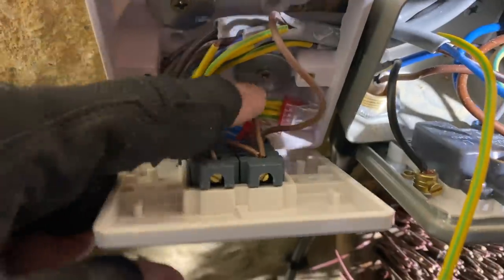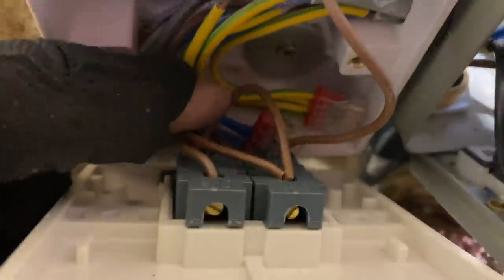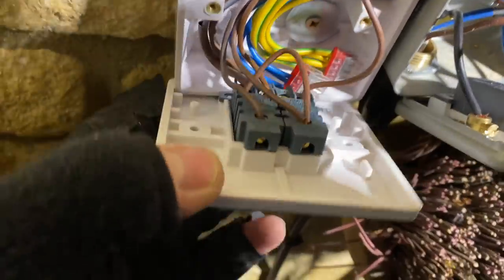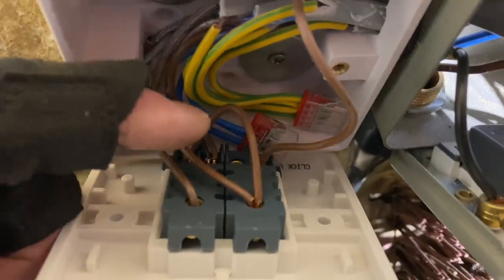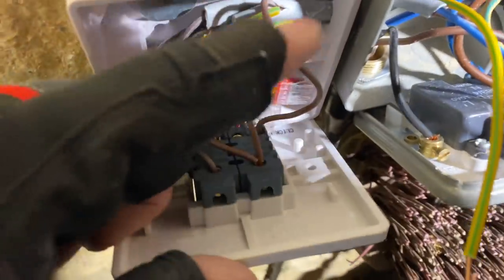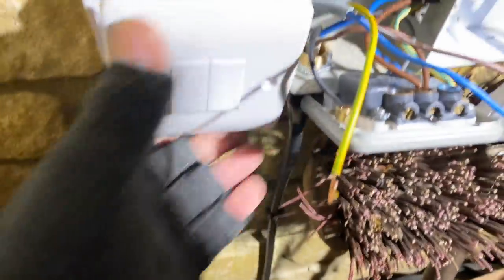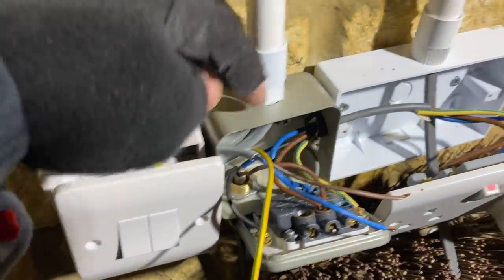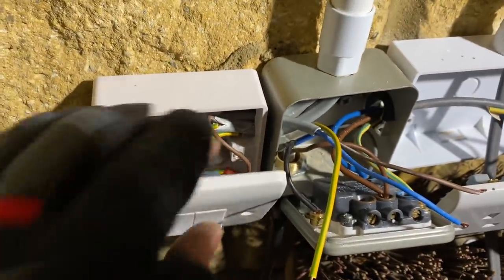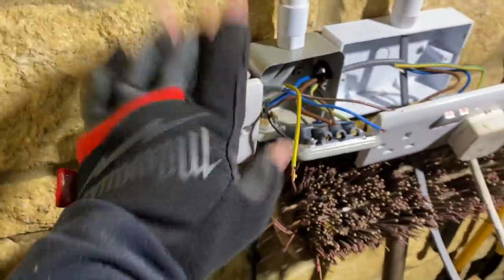Getting dark now. Got our two-way lighting wiring to explain: earths and neutrals - a neutral for the flood, neutral for the garage lights, and a feed neutral - so three neutrals. Then the two-way: three-core-and-earth goes in the common, black in L1 with the switch feed, switch line in the other one. The flood switch line is separate. It's going to get screwed back - I'm not sure about mixing plastic and metal clad, I might change it to all metal clad tomorrow. I'll sleep on it.